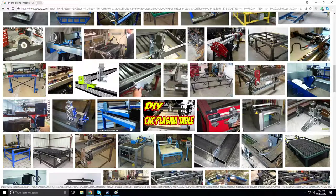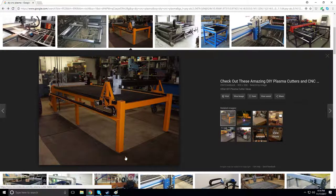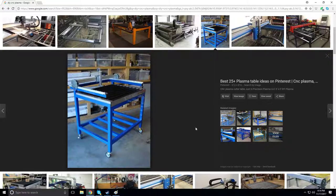For the leg construction I'll probably go with steel tube. The reason is I want to be able to hold a four-by-eight sheet of quarter-inch steel, which is about 360 pounds. I'll want to hold at least that much weight on top of the bed. So I'll probably just buy a whole bunch of steel tube and also use drag chain if I want to manage the cabling.